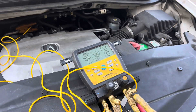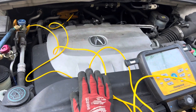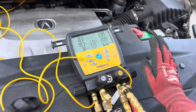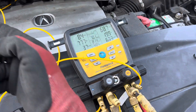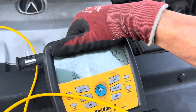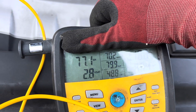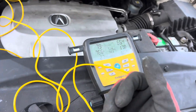Let's see how these YouTube experts read books — superheat is only for piston or orifice tube systems, and subcooling is only for expansion valve systems. We're going to come back in the next video because I'm going to recover this refrigerant now, fill it up 100%, and look — forget the pressures. We don't need pressures, we need superheat. And yes, this is an expansion valve system. Let's come back and see what happens.